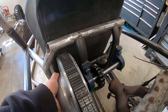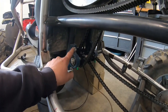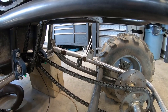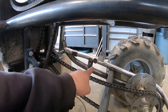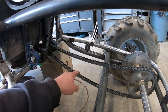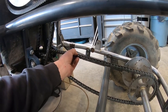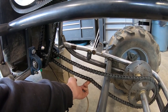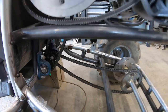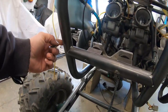Another thing I did was put in our jack shafts. You can see our secondary jack shaft here that goes down to the other jack shaft, which goes out to our rear sprocket. I had to modify the rear swing arm — I took out two tubes and added this one because the chain was contacting them. Right now I kind of like this tension; as you give it gas it's going to get tight there and loose down here. I might put in a tensioner right here. I've also mounted our injection oil reservoir, and I'll probably be putting in a couple gussets to strengthen that up.